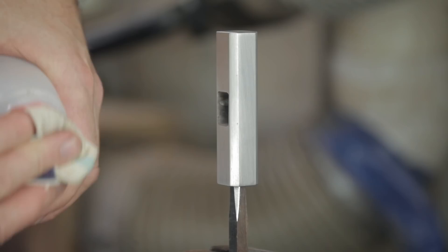I've sanded it to 240 grit, it's nice and shiny, and I could take it further. But because of the humidity here things rust very fast, so I would have to wax or oil it pretty often. Instead, I'm going to try and put a black patina on it.